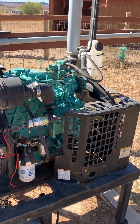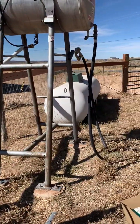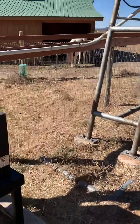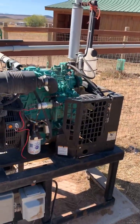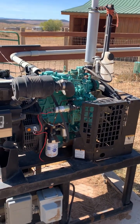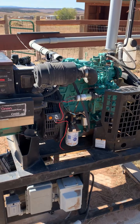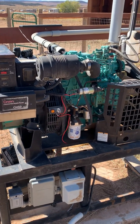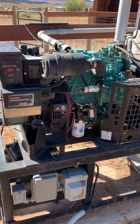Another way you can get around it is to hook directly into your propane tank. If you have a very large propane tank, a propane-backed generator is a good way to go because propane doesn't go bad — it doesn't have a shelf life and doesn't need to be stabilized. But it can run your tank down pretty quick and gets expensive if you don't have a large tank.